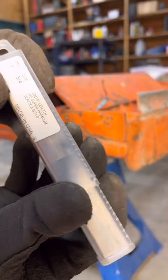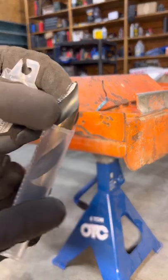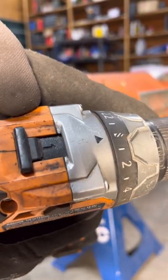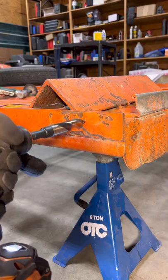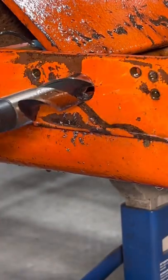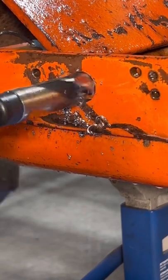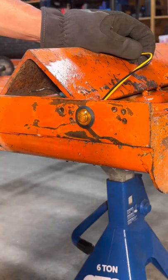This is the secret sauce — a three-quarter inch drill made in the USA, and it's got that step drill tip on it. Make sure you switch to low gear. This thing tears through steel like it's butter, but it heats up real quick. Perfect hole every time.